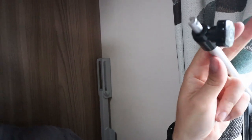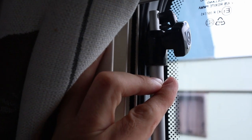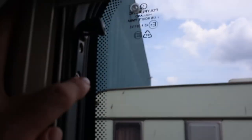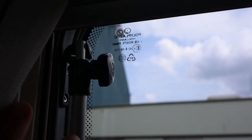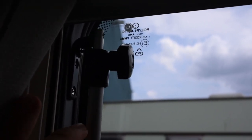One of the things is, as you can see from here, this little safe connector — it's got a little pin up here in the top corner, but for some reason the pin keeps coming out on some of them. I don't know whether the person was trying to fix it but didn't do the world's best job. So what we're going to do is take these two screws out, then put the arm back in correctly when it's off, and then screw it back in. We'll just sort that out.